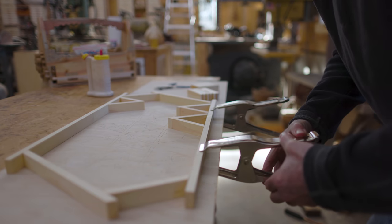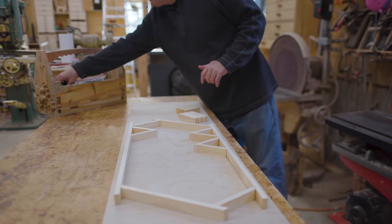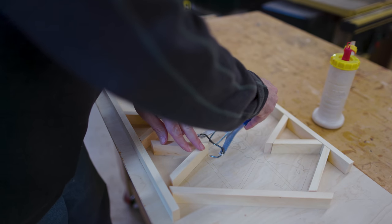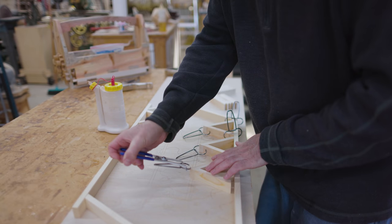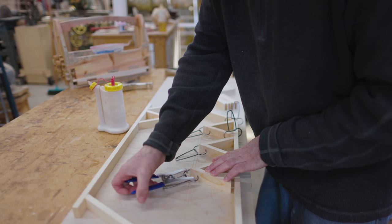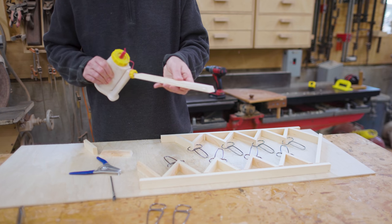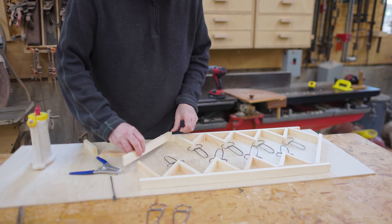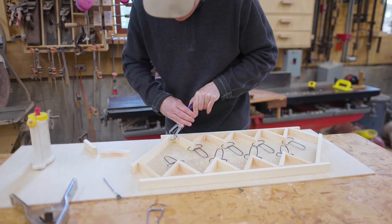As I was going to put this back onto the CNC machine to cut out the triangles, I didn't want to use any metal fasteners — no pin nails. So I had to do everything with clamps and weight to hold the glue in place. I did the lower edge first and let that set up, then used that as a base to attach the other pieces and start working on the rest of the outline of the map.